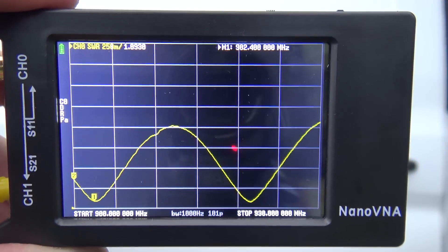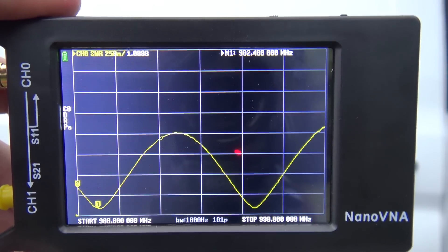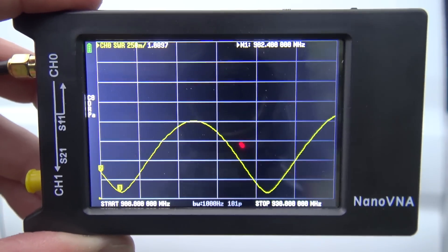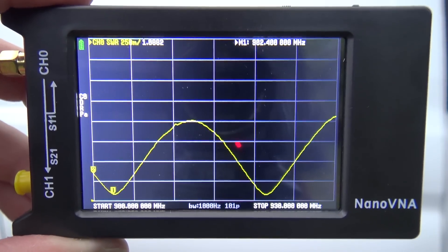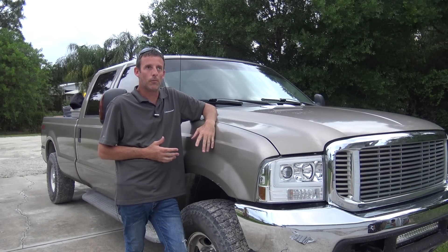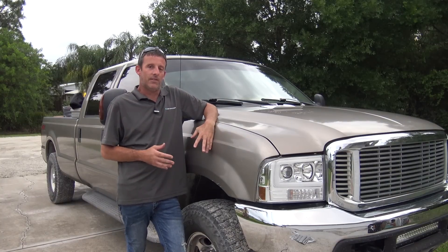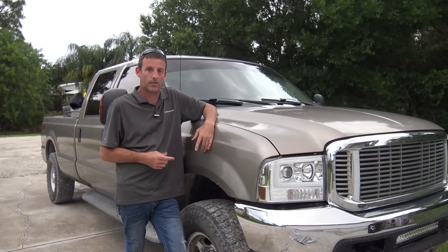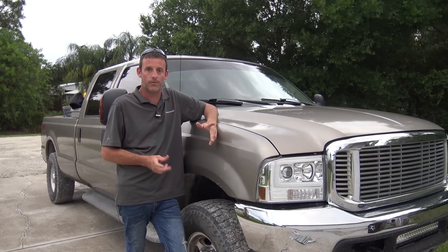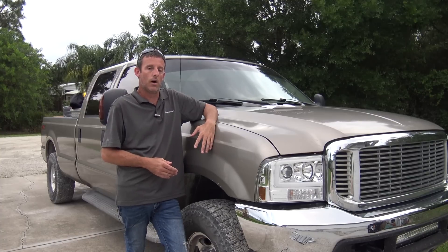In the next video I'll show a comparison using a different mount — this is currently on the Amazon mount. Imagine what it might look like on a Diamond mount; not saying Diamond is better or defective, just that every antenna couples with every mount differently on every vehicle. Using the analyzer to show resonance and performance on one antenna for four different bands is quite impressive. I'll save the on-air test — I've already talked to one person on simplex and a couple through repeaters, hitting a repeater five or six miles away at full intelligibility.